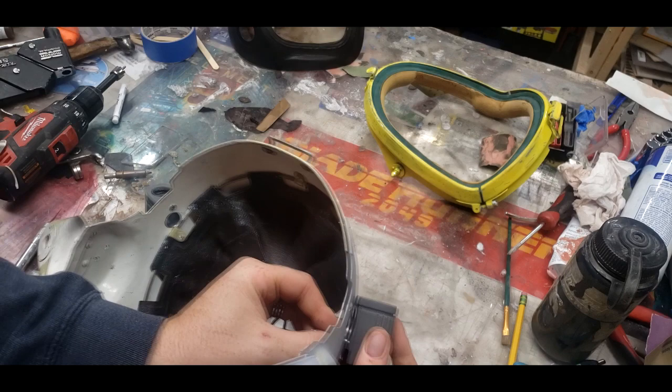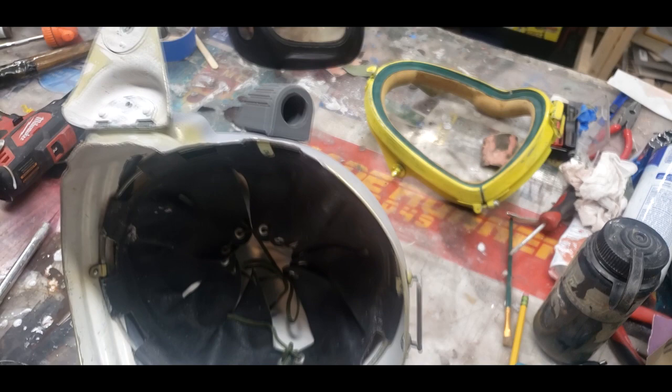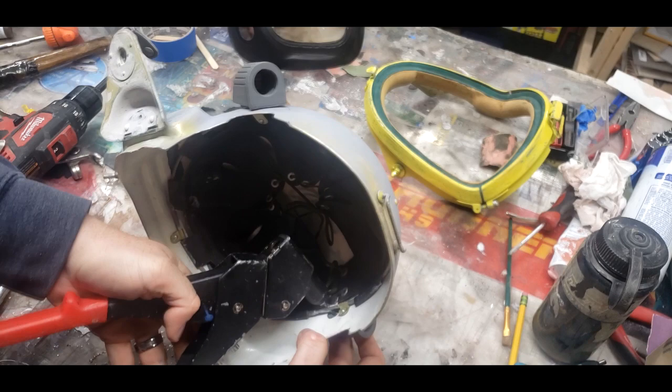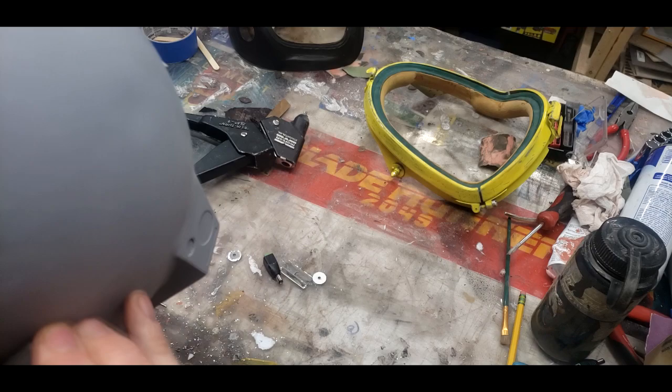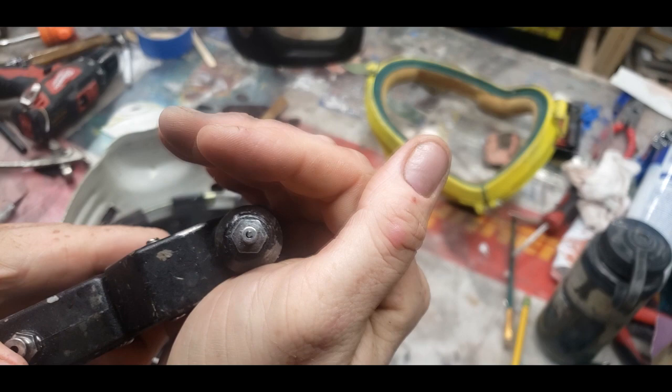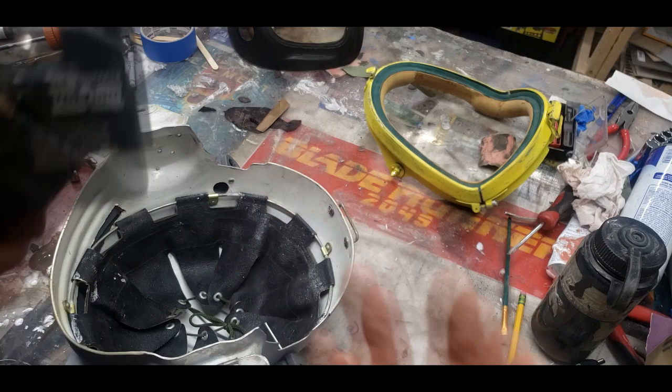Now you don't have to line it up perfectly with the first one. Rivet. It's not a perfect rivet, but it'll do. Occasionally, when you pop one of these rivets, you'll get the stem stuck in there. It won't eject like it's supposed to. Just work the gun back and forth until it falls out.